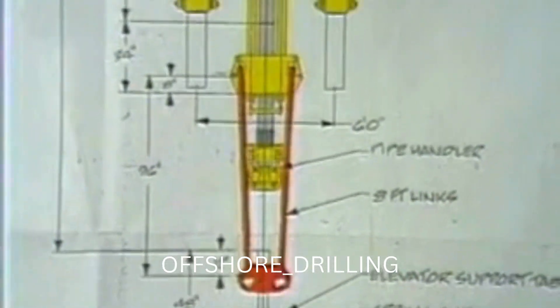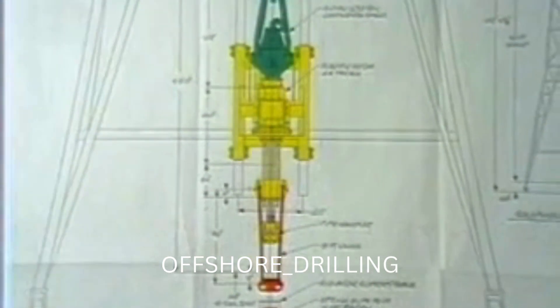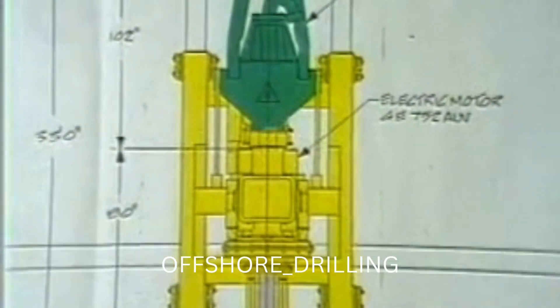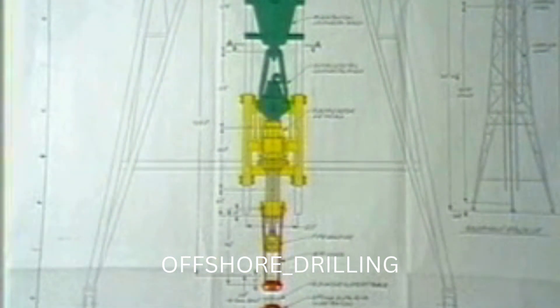Improvements were made to provide more torque and enable the new drilling system to be used in the standard 142-foot derrick and on floaters with motion compensators. To increase the available torque, the railway traction motor was replaced with a square frame oilfield motor with special thrust bearings to enable it to run in the vertical position. An air brake was fitted to the upper end of the double-ended armature shaft and a new higher ratio reduction gear was designed. This change improved the available torque from the system while short coupling the swivel to the drilling shaft, and eliminating the hook reduced the length sufficiently to allow it to be used in a 142-foot derrick.